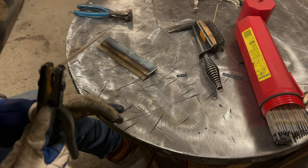Now this really doesn't qualify, I would say, as a horizontal weld, because we're gonna actually be welding almost in a flat position. And it won't be overhead, because if I welded it up like this, that would be closer to overhead, I guess. But in this position, I wouldn't really call this horizontal. If these were thinner plates, it could be considered horizontal, because you don't have a ledge to weld on. So let's get these tacked up.